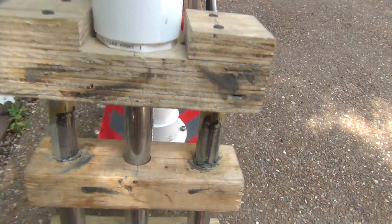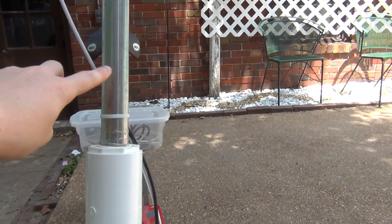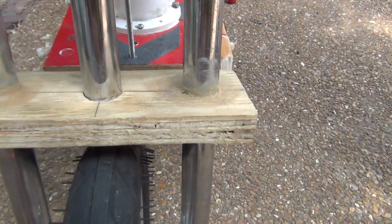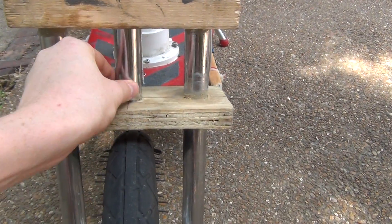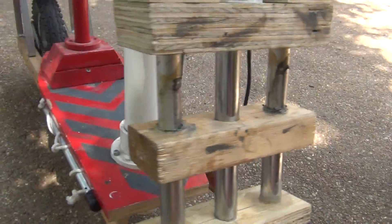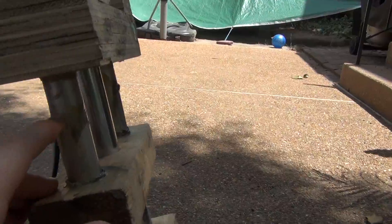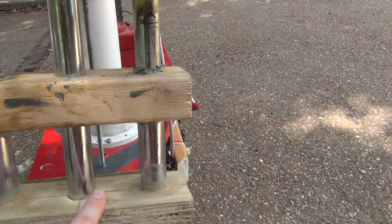This third pole in the middle here was needed for strength. What we did was we took another steel pole and it goes through this metal pole up to about here, and it fits perfectly into here and comes down through this hole. It's loose here and there's a little groove right there — it's not all the way through. We glued a wooden pole inside of this one and screwed it through so this stays here. This pole is screwed to the bottom but goes loose through here, so that it wouldn't keep bending forward. To make it stronger we stuck wooden poles inside the aluminum poles, so basically most of the things are filled with wood to make them stronger.